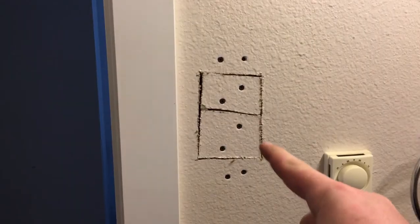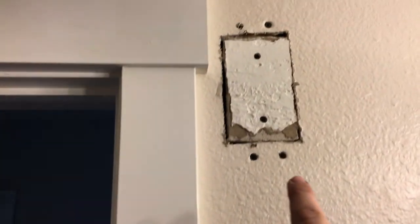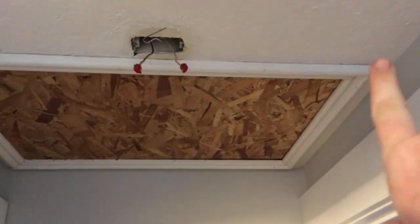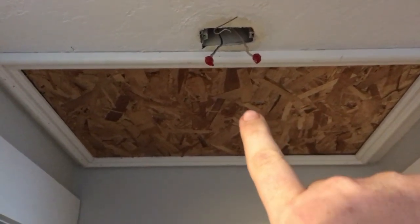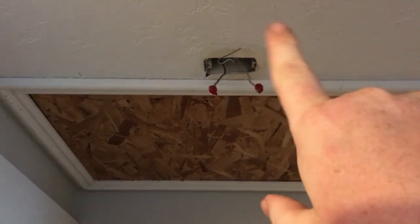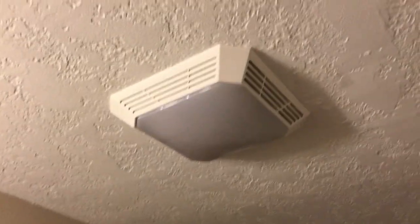You can see I've got screws bottom and top where I put a piece of wood in there, then screwed the drywall pieces back in. I had to scrounge a piece from somewhere else for one of them. Got all the trim put in, got the wood on the inside that the trim is nailed to, and got this plywood in there — it fits nice and tight. On a less windy day we can come back and paint this, even texture it to match the ceiling. Now I can put the smoke detector back up there, I just need to move it to the side just a little bit.